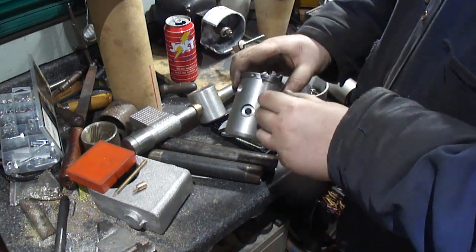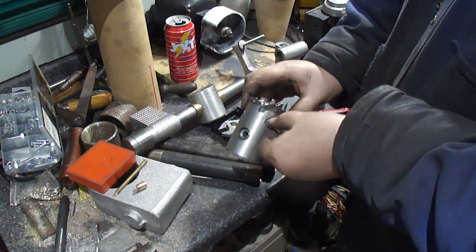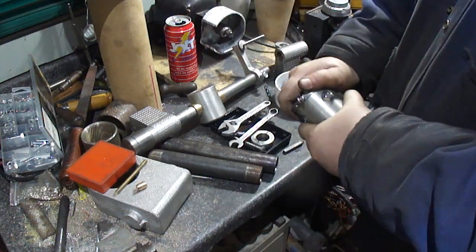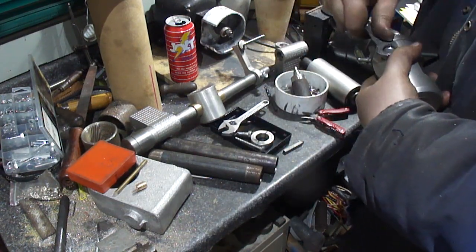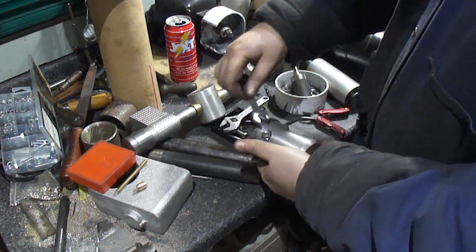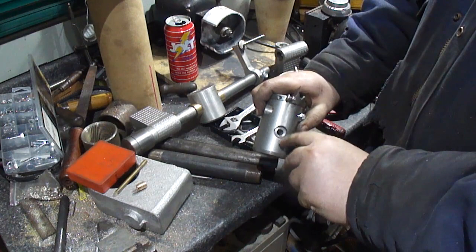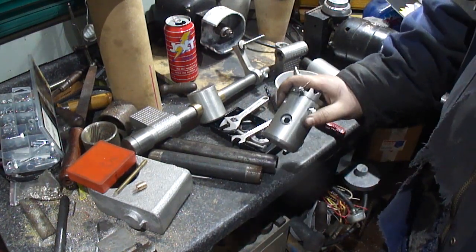Okay, I just stuck a nut in there to bring it out a little bit. It's got plenty of thread engagement, but even the slightest amount of snugging it up, it locks it really tight. And it'll wear in as it goes on because it's kind of loose now, and I'm having a hard time tightening it up because there's not much to grab a hold of here. But it's on there solid now. Anything left to do is make that little tiny bushing there, which is going to be made of aluminum bronze, which is real simple.